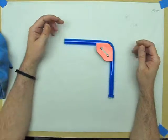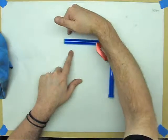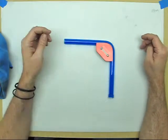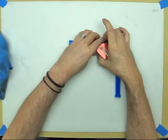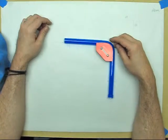Also, because I was using pieces of scrap tube I had left, I went a little bit past our cut mark on either end. After you've had a few bends of practice and you've got a nice clean edge on the end of the tube, when you start your bend, you can real quickly set the tube in place, line it up onto your mark, and then make your bend. And you'll only have one cut to do on the other end.